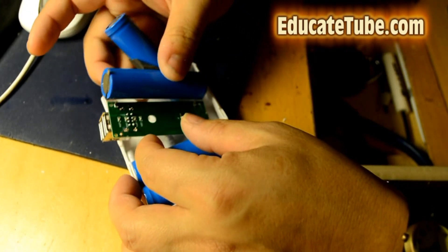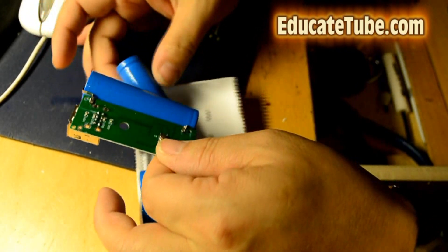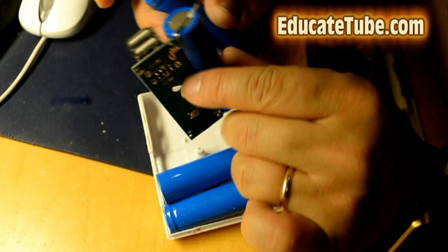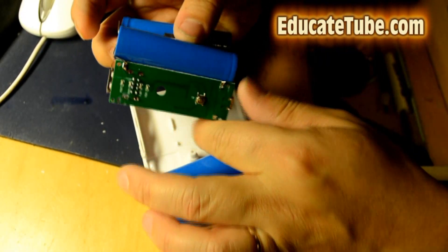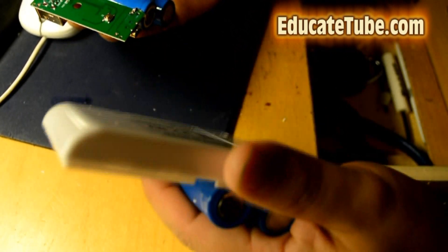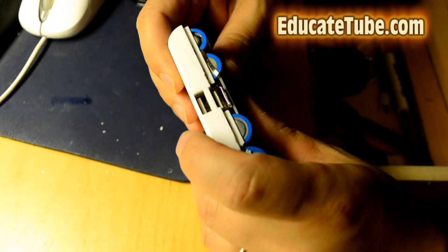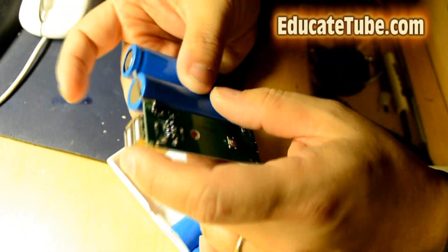Look at how it's made — there's only one lithium battery actually hooked up to this battery pack system. This one is not hooked up, and this one is not hooked up either. What is going on here? This is horrible. So what they had is just one battery hooked up. You get only one-fourth of the capacity — only about 2,000 mAh. And it's not even finished. I'm just amazed. They didn't continue on to hook up the rest.